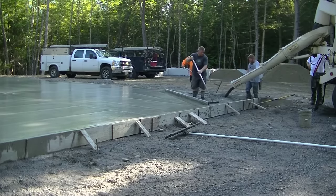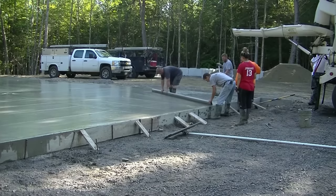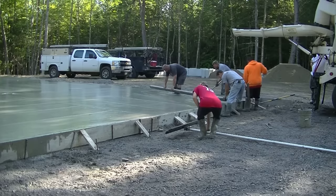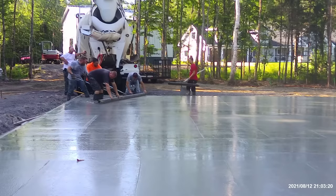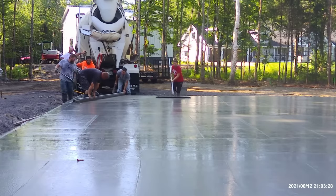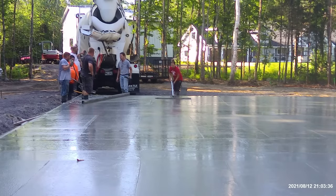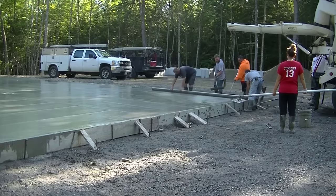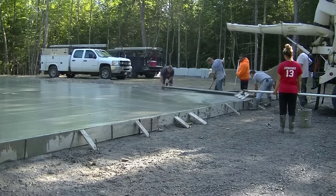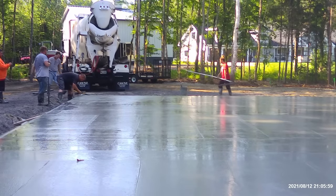So let's talk about cost a little bit — for someone to hire a concrete contractor to come in and do a slab like this. You've got to figure in your cost of labor — the forming, the pouring, the finishing — and cost of materials: the concrete and the rebar. We have a square foot price that we do things at. This one came to $8.50 per square foot for everything — concrete, rebar, forming, pouring, finishing. So for a 60 by 36 slab, that's 2,160 square feet times $8.50 a square foot, which comes to $18,360 for this slab right here to be installed.